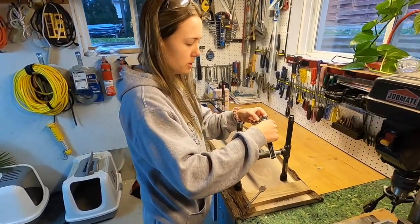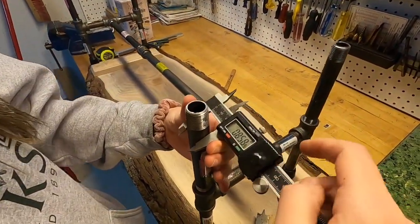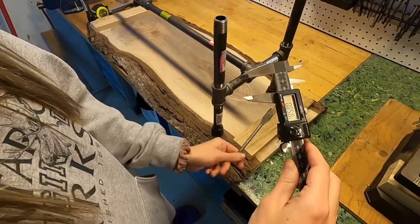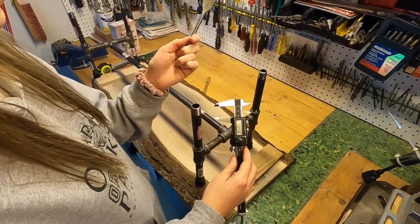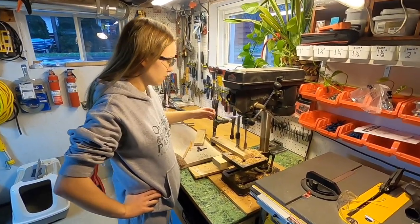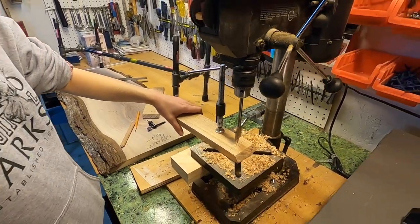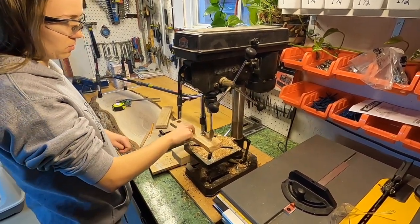What we're going to do now is measure this steel rod — our measuring stick reads about 0.85. So we need something to cut the hole that's a little bit bigger than 0.85, so we have this seven-eighths bit. We have the piece of wood all set up with a clamp here just for safety, so we don't have to hold the piece of wood. We're just going to drill a hole through this piece of wood with the drill press.